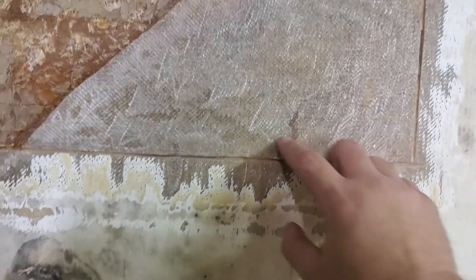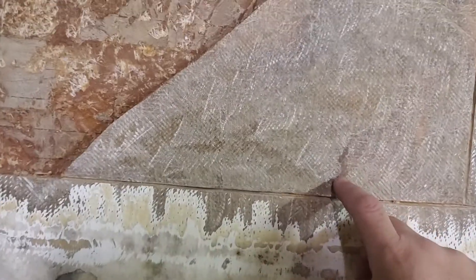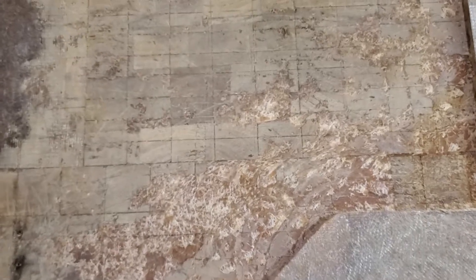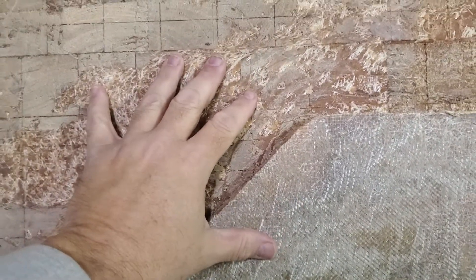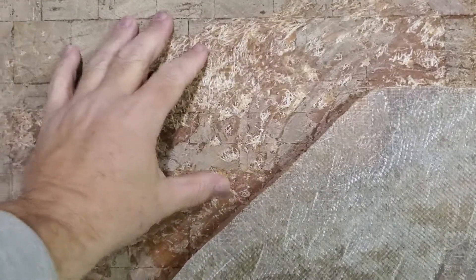He asked me if I could get that repaired and I told him yeah. We're going to dig the rest of this out so we've got a nice even patch area. I've got some balsa the same thickness and we'll lay that in and put a nice patch in it for him. That's kind of why balsa is great for this — because of the squares, the rot didn't travel very quickly. I'll show you why with the other hatch.